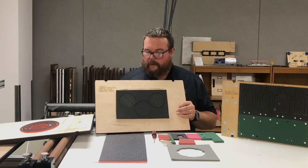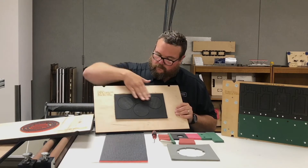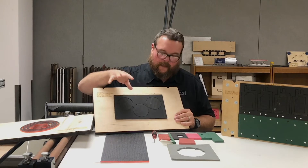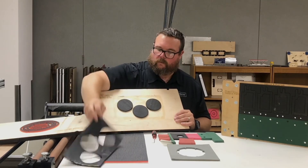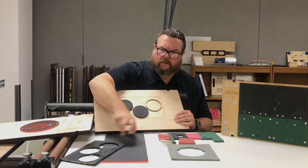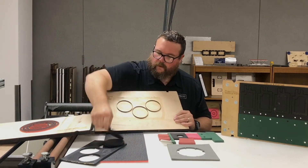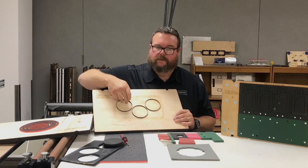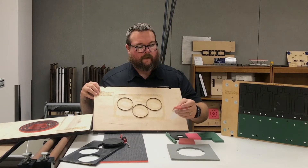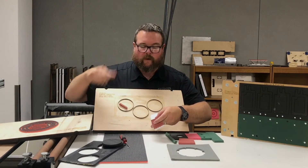So what can we do to avoid that? Typically what we would do is spot rubber the die. We don't need all of that ejection rubber — just enough to make sure the slug comes out of the cavity. In this instance, we would remove the ejection rubber that came with our die, which is usually just glued in with a simple light adhesive and comes out pretty easily. From that point, we would add small strategic points of rubber. There are often pre-cut pads with adhesive — you can simply pull them off and stick them in where needed.